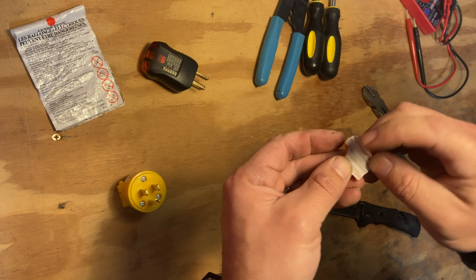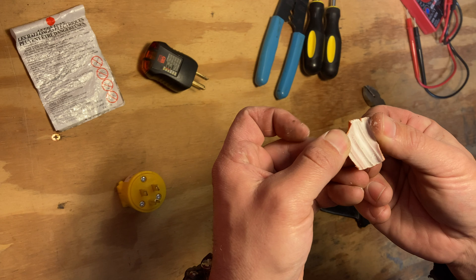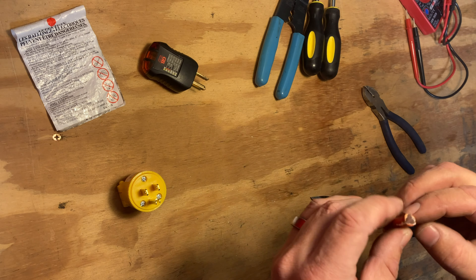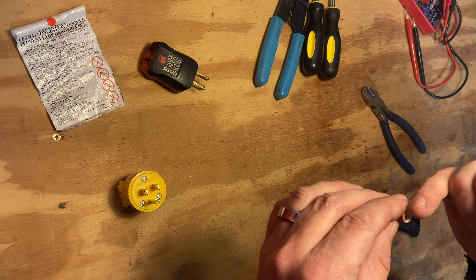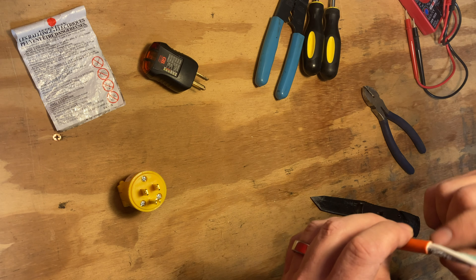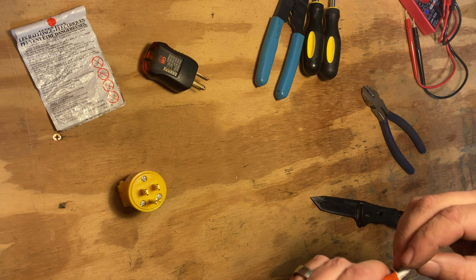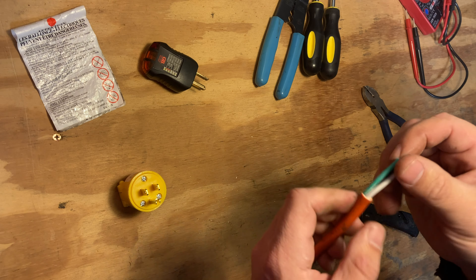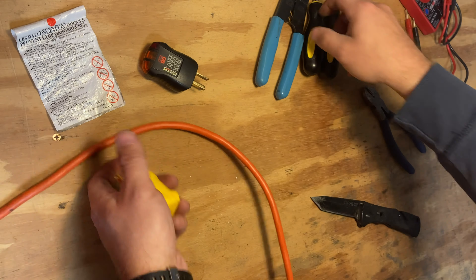So you've got this sleeve — pretty much just a protective housing — and there are grooves that the wires slide right into. When you slice to strip the sheath off, you just want to slice where it's thick and go to a certain depth going around. Practice makes perfect. After doing that, the sheath piece gets pitched, and I take a quick check to make sure I didn't slice into my wires at all. Doesn't look like I did, so we're good.